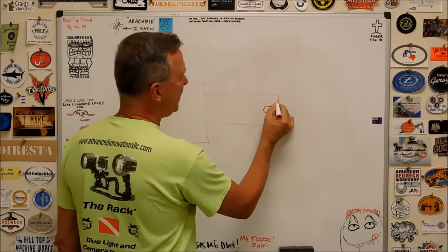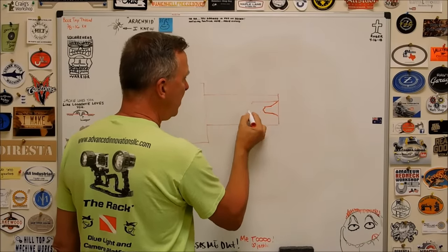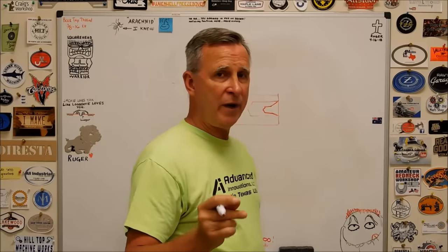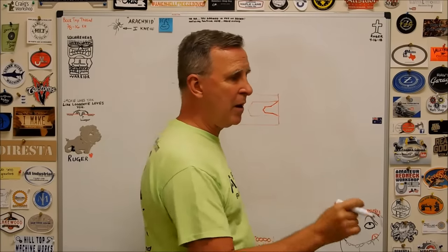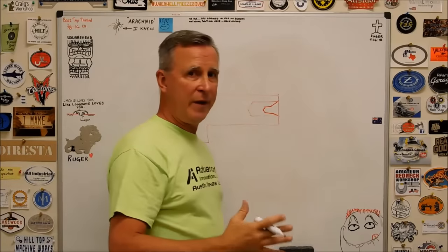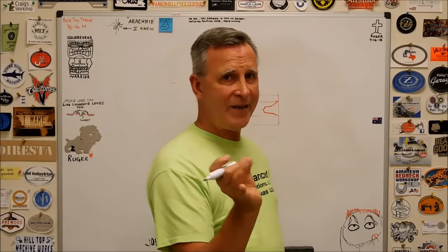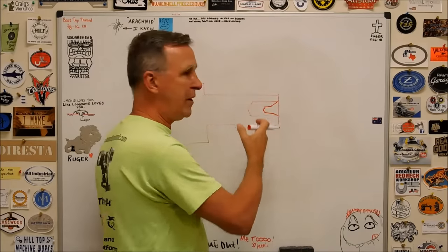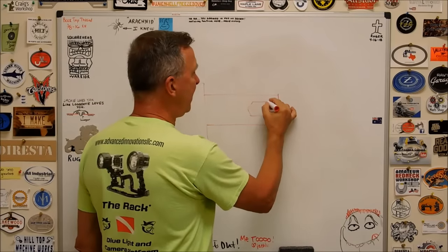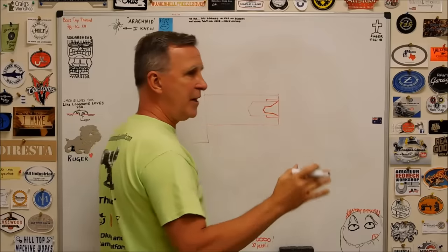In the beginning, put that undersized hole in here. If you have to bore it at this point, if you need a really small boring bar to make sure that that drill didn't do that high point, low point thing that I just showed you before, dust that hole until your gauge pin fits in it. Now, it may be eccentric, maybe it's not eccentric, but put a lead in here. Make sure that that is running true.